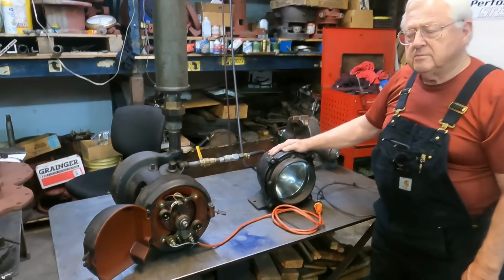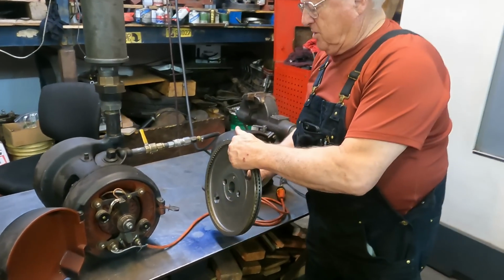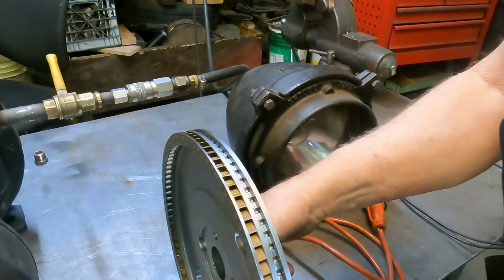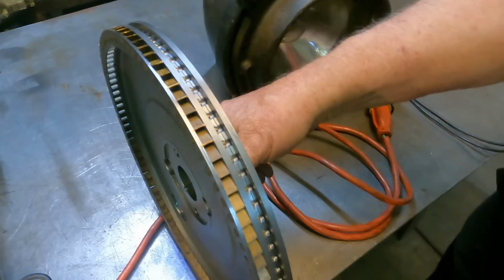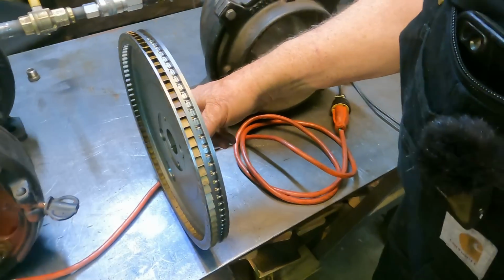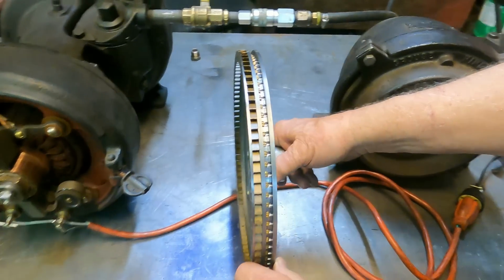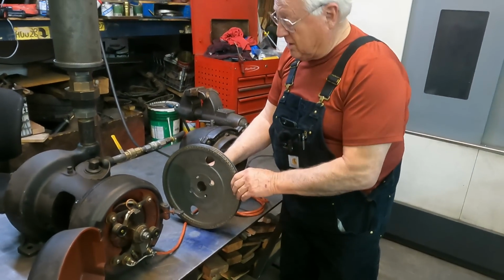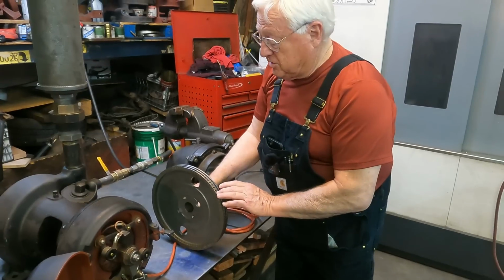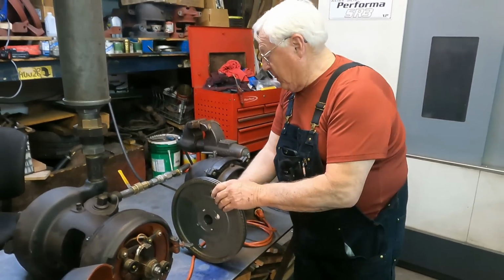And you basically just had the steam piping into this, and that would spin that up and generate electricity, right? Right. What you can't see in there is the turbine wheel that's attached to the shaft that turns everything here. And these buckets are special turbine bronze. And to be honest, I don't know what that composition is, but I have several miles of this stuff that you can still turn into new buckets. But this is the turbine. A larger version than would go in here, but it's the same principle. So the steam would hit that and just spin it around.